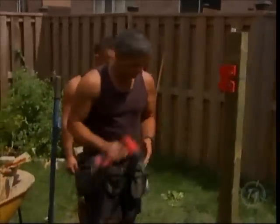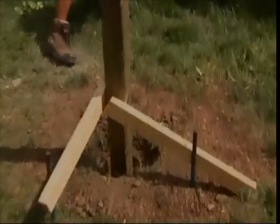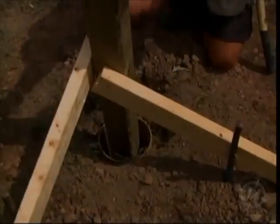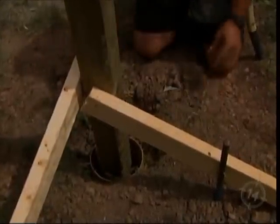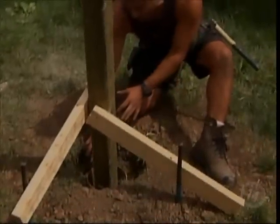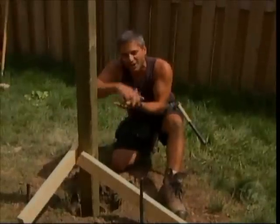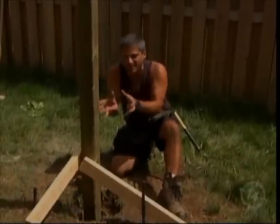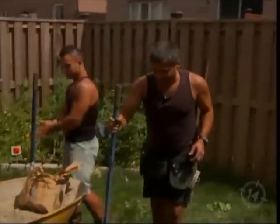Now, this is important. If you want to focus in right down at the sonotube, let me set this aside. Now, we have an 8-inch diameter sonotube. We have a 4x4 that's 3.5 by 3.5. I'm pretty equal all the way around. That's very important. I've seen guys set the post all the way to the far left, far right, or front and back. And then, in other words, you don't get concrete on one of the four sides. Now we're gonna have equal amount of concrete all around the post going down 4 feet. That's what's important. Now the fun begins.